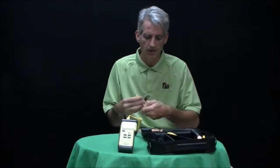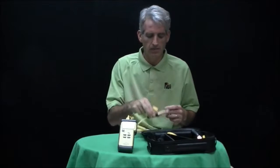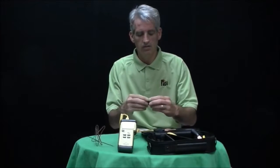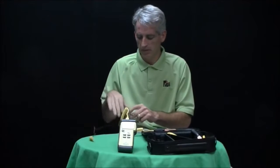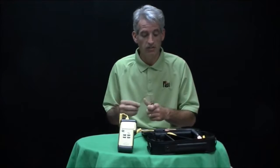The GK13M is valuable when you run across something that's a little bit larger than these pipe clamps' jaw openings will accept. You can use some of this Velcro wrap and wrap these thermocouple probes around the particular pipe that you're looking to measure the temperature of, and you can get your temperature that way.